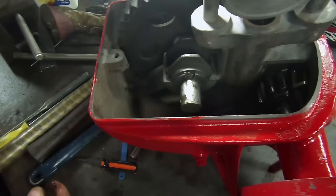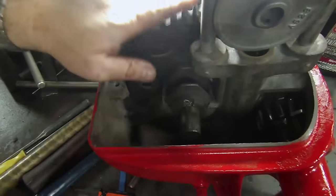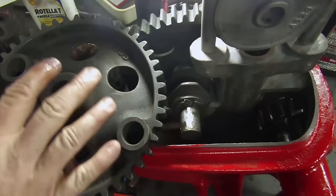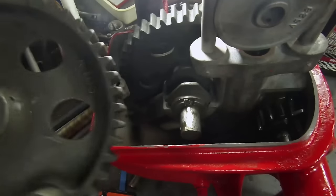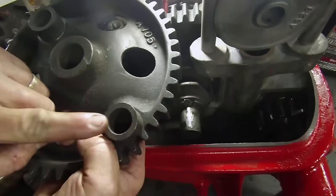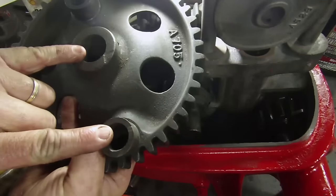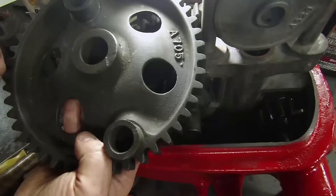Now there's a gear back here on this side — you see this gear back here, there's a parallel set of gears right here. It is exactly identical to the other gear. We have to make sure that this gear and this gear are timed exactly the same. Now there's a witness mark, or an indexing mark here. There's a pin that goes through here, so it can only be one of two directions, 180 degrees out. But our pump rods — our connecting rods — connect either here or here to give us our different stroke lengths. So there's a short stroke here or a long stroke here. Depending on whether you needed a longer or shorter stroke to operate the pump, you could make a couple quick changes within the windmill and set it for different variations.